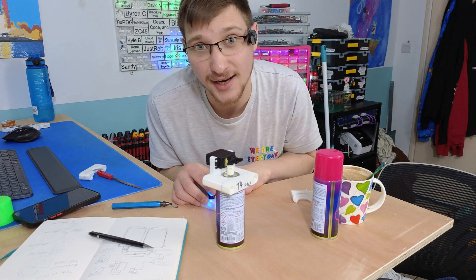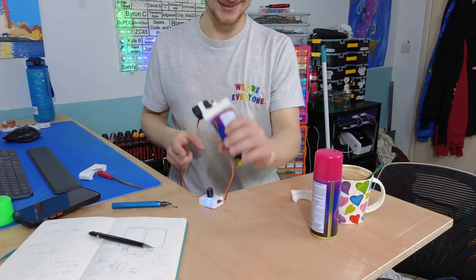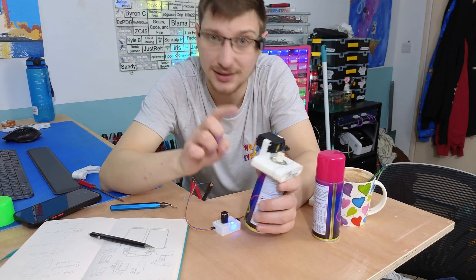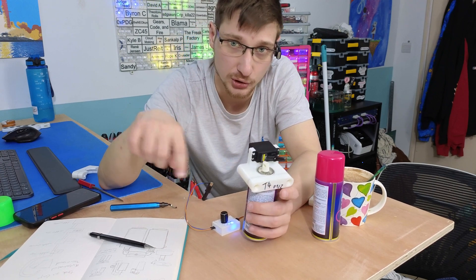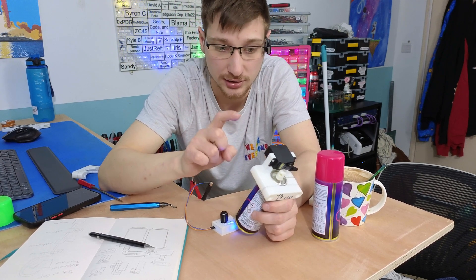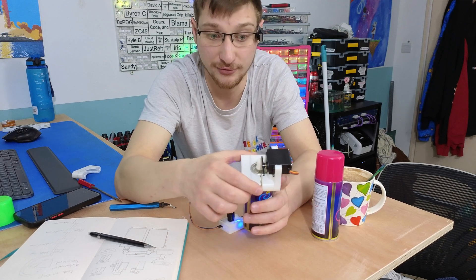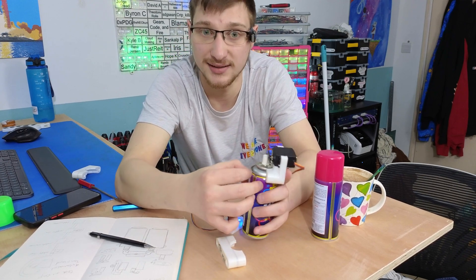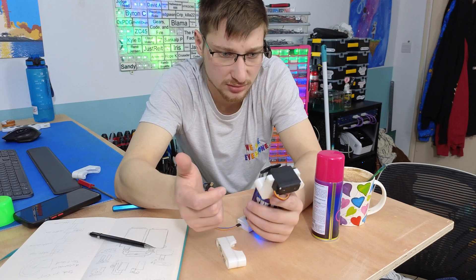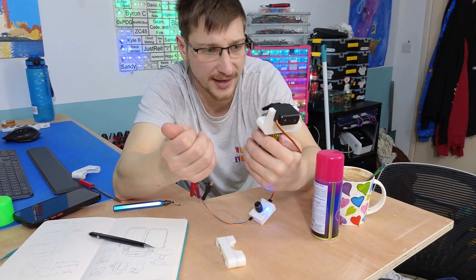It's perfect! The can is mostly empty which is kind of perfect for testing. My next steps are to mount a microcontroller — probably here — along with a voltage regulator, because last time I used these servos with a D1 mini over USB power I kept frying the little voltage regulator; this servo pulls a lot more current than it can deliver. I'm also thinking I can make this back part a lot thinner — maybe just a zip tie around here would do.